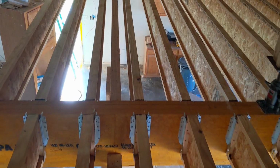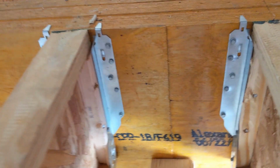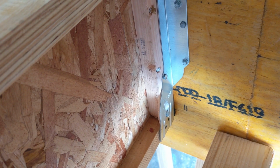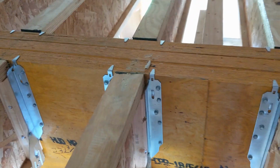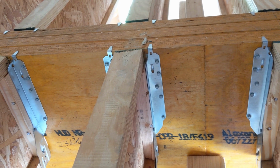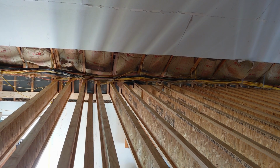Over on this side, I did 1-inch blocks on either side of the web. They're 9 1/4, so one side or the other is not touching the flange, so they're not wedged in there this way. And then I'm using the specifier nail hole to stick in a 1.5-inch nail into there, and then I am toe nailing the flange into the LVL, and that is keeping this just nice and firm. It's not going to move, it won't twist or rotate or pull out, which is my main concern until I get the knee walls built that will be bearing more of the weight of the rafters.